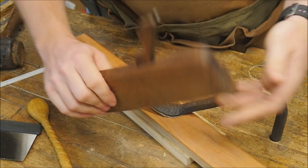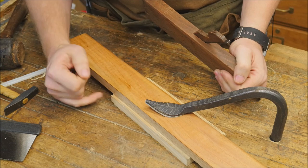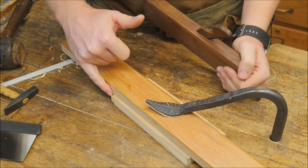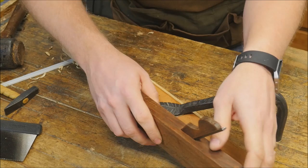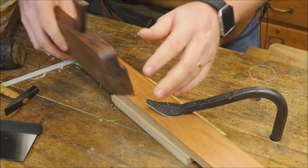So I'm just going to start going. Every pass it gets a little bit deeper. What I'm looking for is this edge — the corner of the tail — to be a perfect sharp corner. I don't want a flat spot on top, and I don't want this to go down farther. Normally on the far edge you're going to finish early, so on subsequent passes I need to stop before I get there. I'm just looking for consistency from one end to the other, making sure I have a really nice sharp edge on that tail all the way across. One final pass and that tail's good.